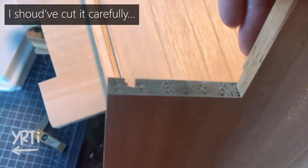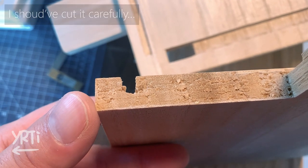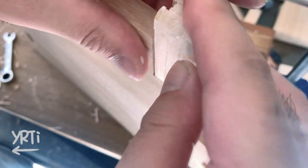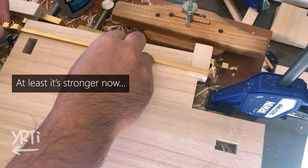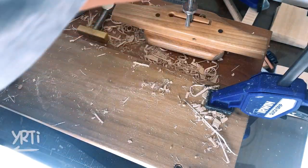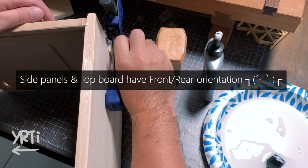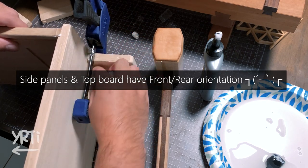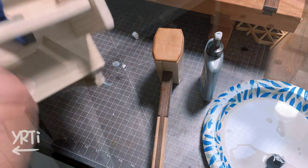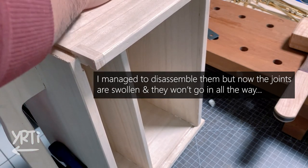Paulownia is soft, so the fiber broke where I'm supposed to insert a sliding door. This part is visible, so I ended up cutting a joint on the edge and attached another piece to reinforce it. During glue-up, I did a super stupid mistake — the piece I'm gluing is for the other side, so the edge fix I made for the front sliding door ended up on the rear side. In addition, I cut one rabbet in the wrong thickness on the top board, which I'll explain later.